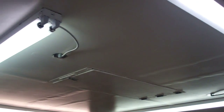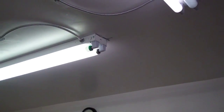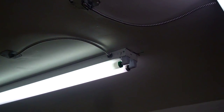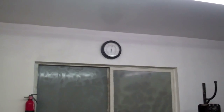I got it all painted and tomorrow I'm going to put up the lights. I got the lights up. Before I put the sheetrock up I wrote down where each light is going to go and marked the inside of the lights so I'd know where the screws go. I mounted the electrical boxes about a foot away and just ran BX cable to each light — it was much easier than trying to get those boxes in the right spot. I got all my hose and cord hangers up, the fire extinguishers, and the thermometer.